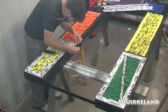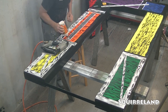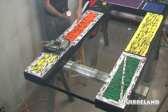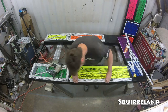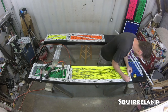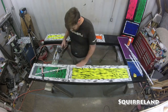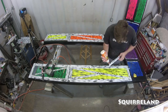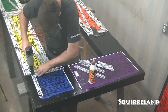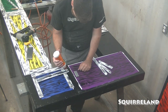These panels are made to be outside and in the weather for three months out of the year. That in mind, I need to make sure that everything has protection from the elements. That's why I do the first coat of white primer on the trim boards by hand and then spray on the other coats afterwards — I want to make sure each board is completely coated on those skinny edges. Protecting everything from the elements is also why almost every board was fully coated on every side before assembly. I don't need all of this hard work rotting or growing mildew from the inside out when in storage for nine months. When I build stuff, I build it to last — I plan on being able to use these panels for decades to come.